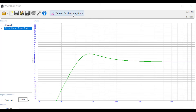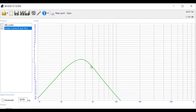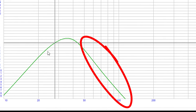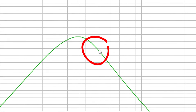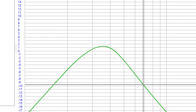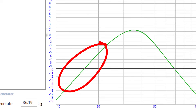If you were to fire up your computer and go to something like WinISD, you can go into this menu when modeling a subwoofer and WinISD will show you the gain or the volume or the sound that you're getting out of the port itself. What you can see is that at higher frequencies, the port isn't resonating, so it's not making any sound. And as the frequencies drop, the port begins to resonate and the port begins to make some sound. And as the frequency continues to get lower, the port stops resonating and you get less sound out of the port.